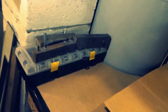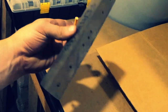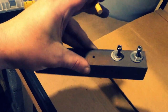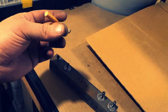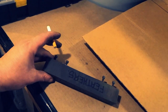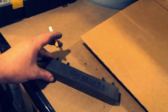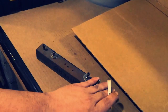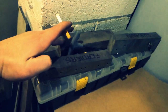The table that's normally filled with blades is all covered up because there's some top secret stuff I can't show you. These are basically just blocks of micarta that I drilled and tapped so I can bolt blades to them. It saves my hands from the heat of the blades while I'm grinding. It's not a jig because I'm still freehand grinding, but it keeps the heat off my hands and I can do two at once — one on each side. I've got one set up for featherweights, one for karambits, and another one for whatever.